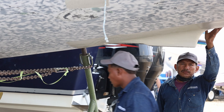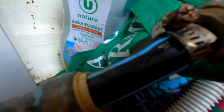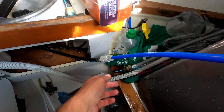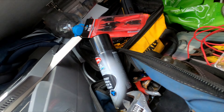We have about a week and a half to two weeks of water with full occupancy on the boat, so I needed that water situation dealt with. I went down and checked inside and it's wet in here. I'd been suspecting a leak somewhere — and here it is, right here on the hose barb where I placed it. It wasn't fun, but I got it off. Now we just have a straight connection from the cold water supply to the water maker intake.